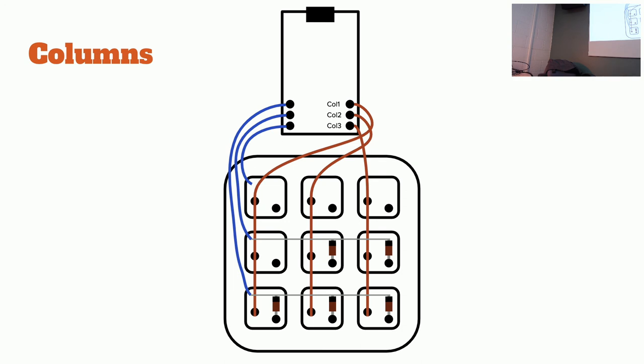So my first hand-wire was this keyboard with a laser-cut wood case. It was nice. I put it all together, and I was super proud of it. Plug it in, and it's all borked, just spamming keys. It ended up being because the insulation on the wires I was using melted, so the wires were crossing at various connections and constantly pressing keys. I had to find those and detach them, and it was a huge pain.